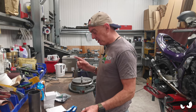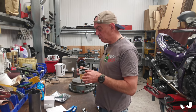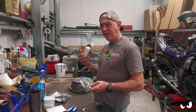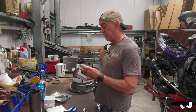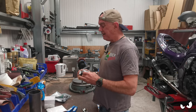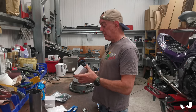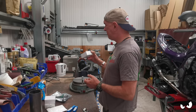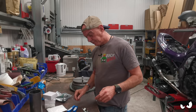I've had some deliveries. Postie's been. So I've got three more of these quick change tool posts for the chuck. I'm just finding that as I'm using more tools and making my own, I'm getting fed up of having to keep swapping them out in the holders and setting them all up again. So basically all the tools I use on a regular basis are just going to go in their own holder. I am going to stick a shelf up across the top at some point just so I can grab it and stick it on. But we've got three more of them.